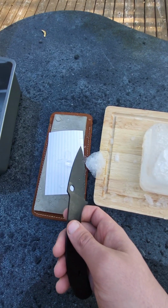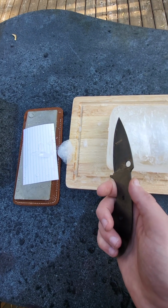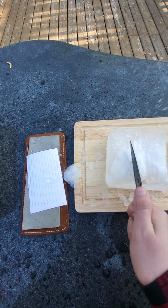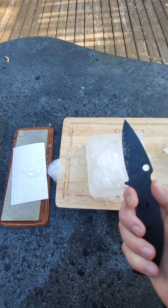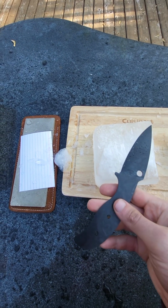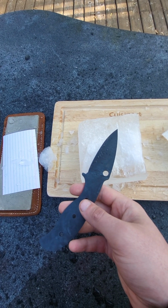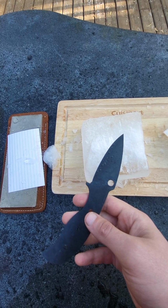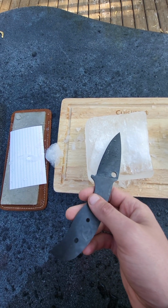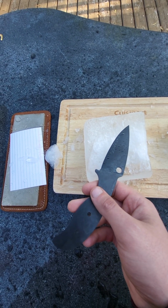In my testing, I used the index card as pass or fail. When I started testing, the sanding roll got 220 cuts. I used the 1K super vitrified diamond stone to get that number. Sharpen it up for I think 4 or 5 minutes. That number went to 500. Did it again. We went to 630 if I'm not mistaken.